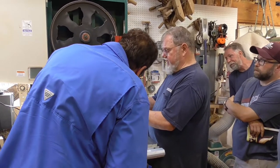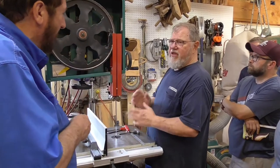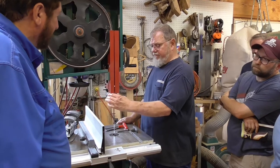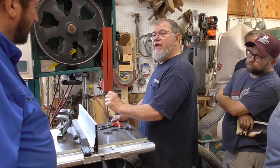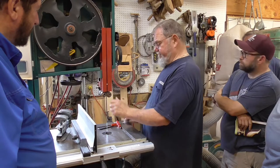And then come off just a little, they say a piece of paper width. So you don't want it touching and riding the whole time. You'll be able to pull the paper out. About 3 pounds. And see, now I'm turning that bearing and it's moving the blade, so that means I've got it too tight. There we go.